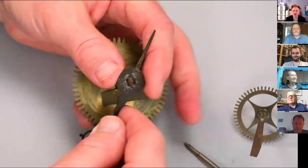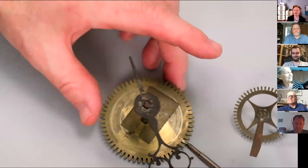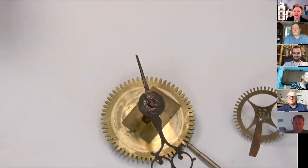we've got a slightly polarized situation, because the clocks that we would advise you begin on are machine-made clocks. And so the components there tend to be, if you imagine a shaft with a bearing, that thing is parallel, okay, like it would be inside a car or any modern bit of machinery. And that's because of the post-industrial revolution technology, and clocks, of course, and guns were one of the first things where we have interchangeable parts and so on. You have parallel parts that can be made to be interchangeable.